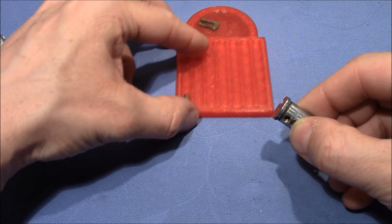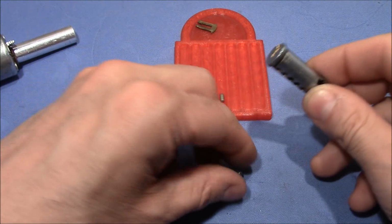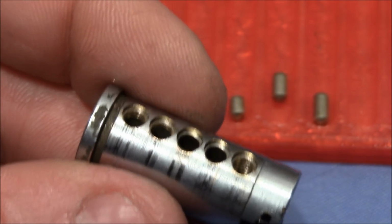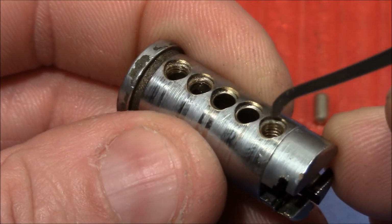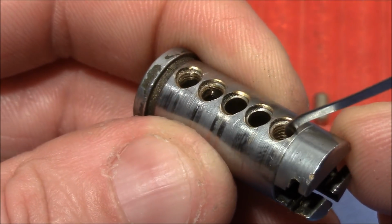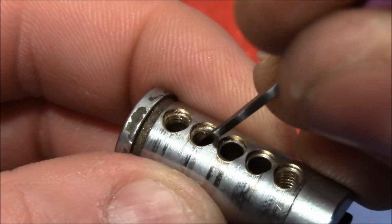Number 1 is a standard. Number 2 is a standard. Number 3 standard. Number 4 standard, and number 5 is standard. But the plug is not standard. We've got some heavy plug modifications. Wow, look at that. We've got enlargement in each and every one of these plug chambers. So there is this lip and it gets wider towards the shear line. And we have threading in 5, in 2, and in 1. 1, 2, and 5 are threaded. No, it's not threaded.